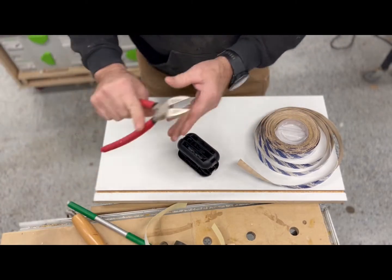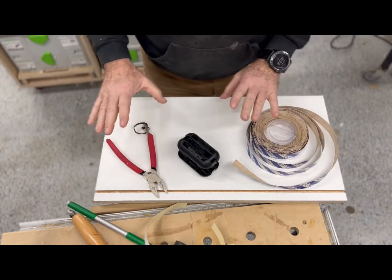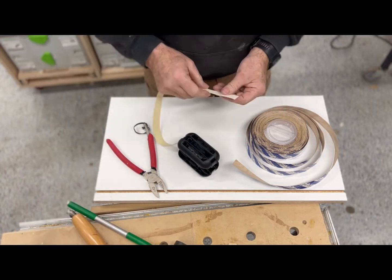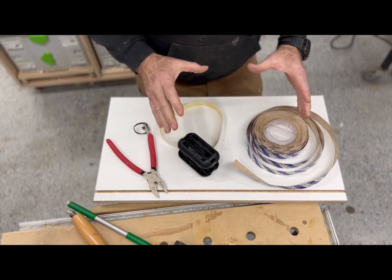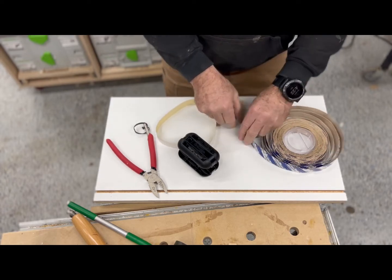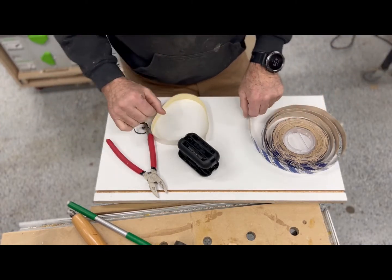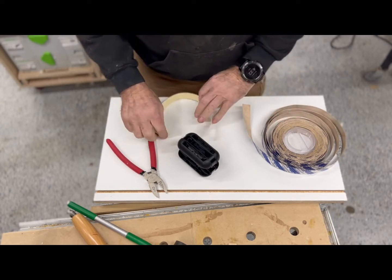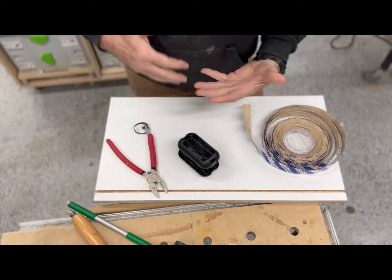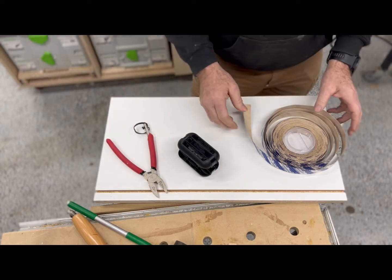And then the other thing is a flush cut. So you can come in here and clip the end so that it's flush. That works pretty well. It's kind of tedious. And then, this stuff is pretty thin, but for a while I had a setup from Rockler that you'd put your rolls on, and then it would put a heat gun onto your edge banding, and basically you push the band through. I'll try to put a link up to that in the description. That one worked pretty well. It was a little tedious because every time I went to use it, I felt like I'd have to recalibrate it, and I just never got it to work well. It melted well. It was just trying to get it set up.